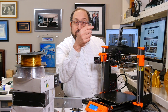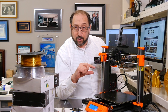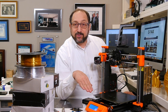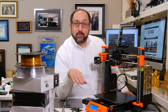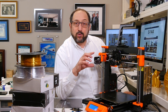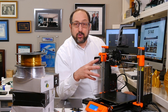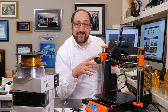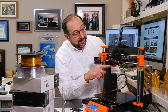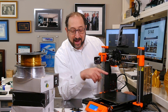When you have a 3D filament-based printer, your filament goes through a cool area called a heat break into a hot area, then to the print surface. There's a fan to cool the filament on the print surface and a fan to cool the heat break — the area within the extruder mechanism above the hot area. We're going to take off this orange shroud that will let us gain access to the nozzle.